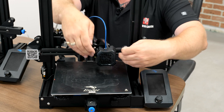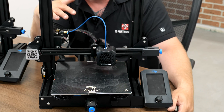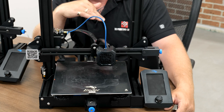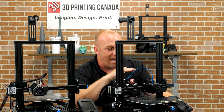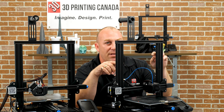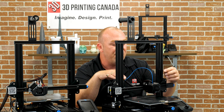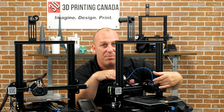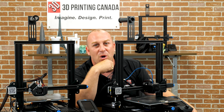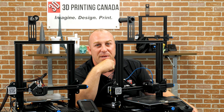This is something that will happen on any tube-to-nozzle style machine — it doesn't matter what machine you have. That tube lifts away, lets a little bit of filament out into the throat where it shouldn't be, and eventually it seeps out on top of your hot block. From there you end up with the big ball of death, which probably means you're going to have to replace your thermistor and heater cartridge.